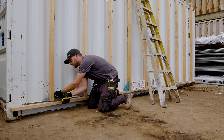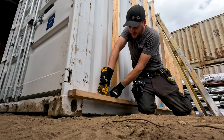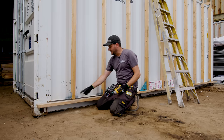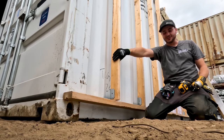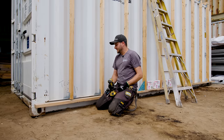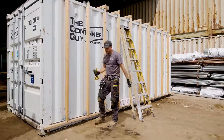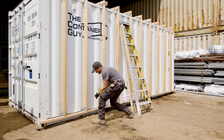Comment down below if I'm doing this wrong, or if we should be using the three-eighths bolt through there — we have that laser cut in there for you guys as options. These things are pretty stiff. Even just the bend profile to grip the true inch and a half of a two-by-four stud — I think it's 1.47 inches of inside dimension so that it really grabs that two-by-four. It was difficult for our brake operator, but he got it done. It really just holds these things in place while you're working. I can't get under there to screw or air-nail normally, so I'm just going to toe-nail them.